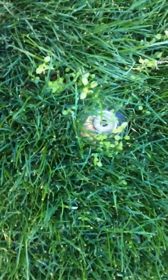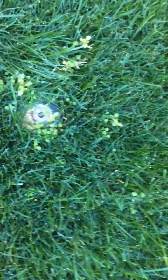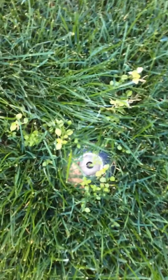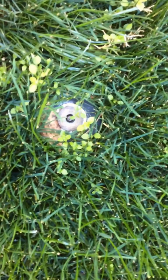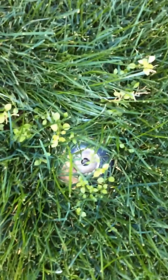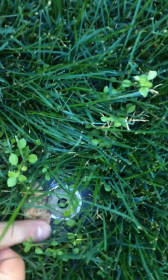In this video, I'm going to show you a couple things you could do to determine the age of your sprinkler system. One of the most obvious parts you're going to look at is the sprinkler heads themselves. So this would be a lawn system. If you have a drip system, that most likely is a more current system installed a couple of years ago. Here is a lawn system, which is about 20 years old. The heads have been replaced several times, but right here is a more modern head.